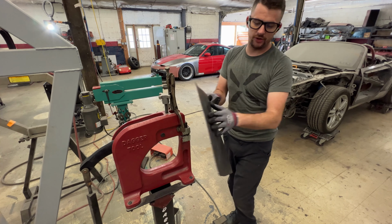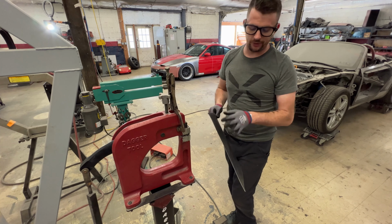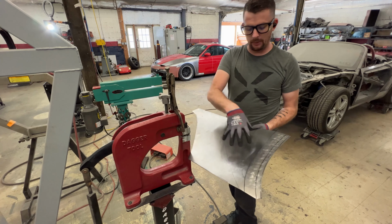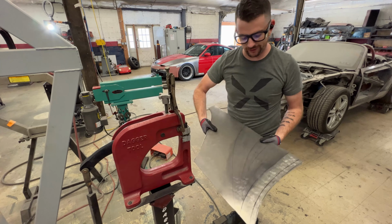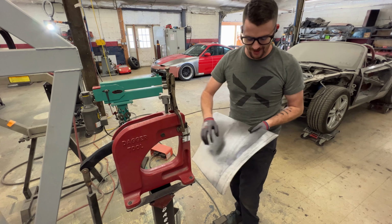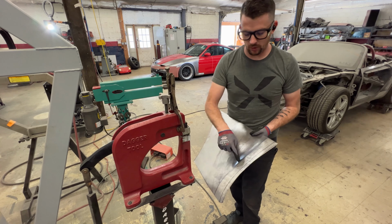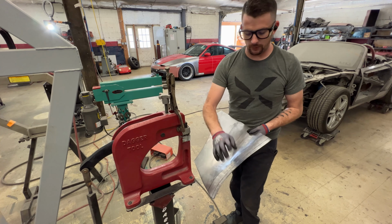I got my pre-stretch, I got my pre-shrink here, and this edge here is probably gonna need pre-stretch for another flange, but I'm gonna get there in a little bit. I'm working from here out. I have this already, which is roughed in, it's not that great. It's there, that's about it. This flat part here, I need to get this edge crisper so I can work with the metal here and keep it trapped in that. And then after I get this where I want it to be, I'm gonna fold this flange over.